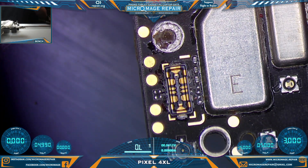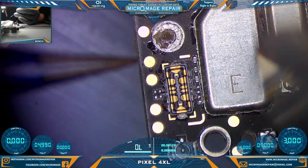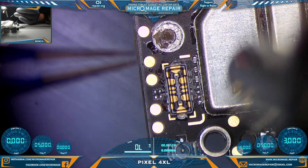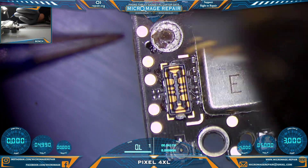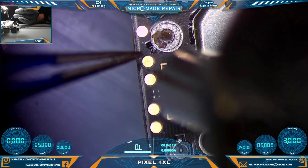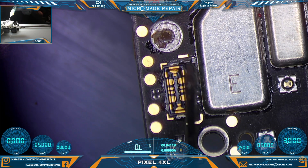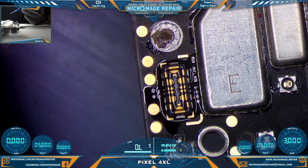I'm going to have to bring the temperature up, it feels like. We're just going to go 480 degrees and try to work quickly. We're just going to drive that heat away from that antenna connector as much as we can. Okay, seeing some tack-down there. Bringing in the flux now, and we're going to bring up the airflow — just get a quick reflow, make sure it's in place.